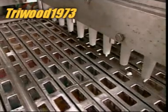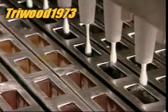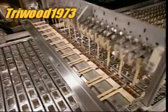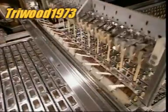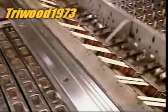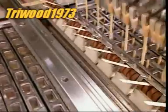The shells are still floating in the brine as they reach the filling station. The machine shoots in the ice cream, overfilling the shell to create a one centimetre cap. The ice cream begins to harden in the cold brine. Once it reaches a semi-frozen state, a machine — appropriately called the stick inserter — places a wooden stick into each mould.